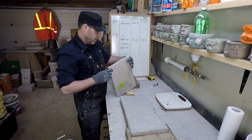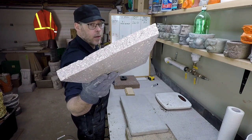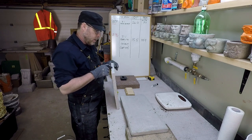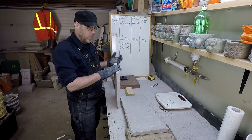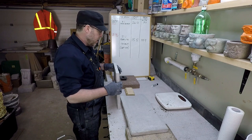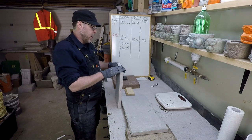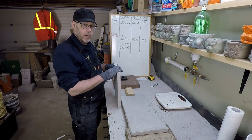Two point nine six — less than I would have thought. Again, a wet mix. There's no obvious fault line or anything, but take a look at that consolidation — it's pretty good. I would have thought it would be stronger, but you can see the hydration lines on the surface; that was a pretty wet mix. I don't really expect perlite to be one of the stronger ones — it's not really my go-to. I would prefer vermiculite for a stronger mix. So two point nine six is one of the lower scores overall. There was a little wiggle to the bucket that could have contributed to early failure. I'm not done testing — I'm gonna make new ones and try it again, and maybe we'll learn some more about lightweight concrete.